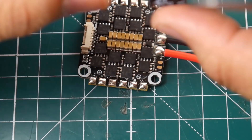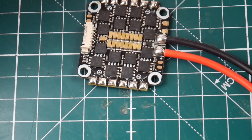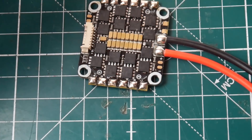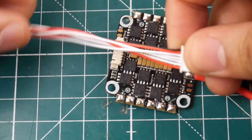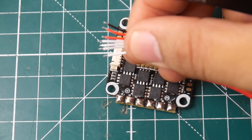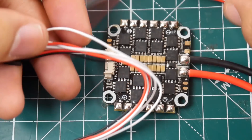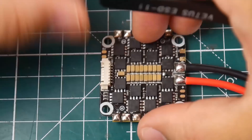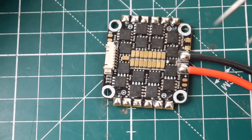It's a 25V 330 microfarad Rubycon low-ESR capacitor. They also give you two JST connectors — they appear to be silicone wire, with a servo-type connector at the end. You get two of these, which is very nice. You can access V-bat via these connectors, as well as the 5V pad and all motor outputs.